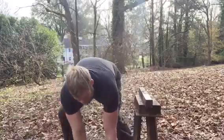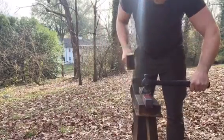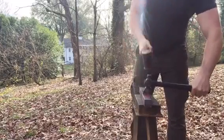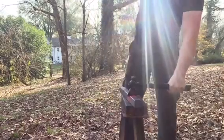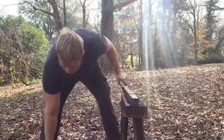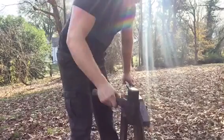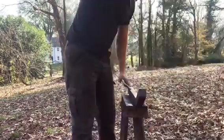We've got to get a heat out of the inch-and-a-half square, so we're just gonna use our handle hot cut on the center punch mark. I'll switch to a six pound hammer to try and speed things up. Hopefully we'll get over it on this heat — we should be able to shear that off now that we're most of the way through.